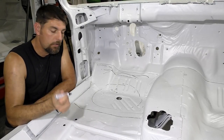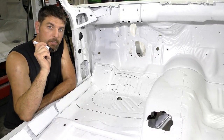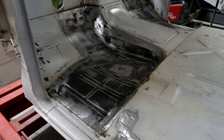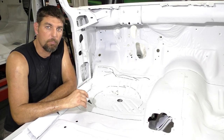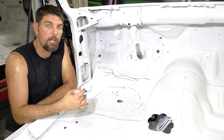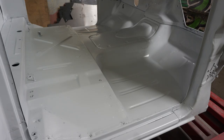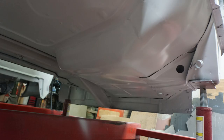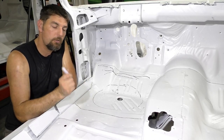Stay tuned — I'm going to cut it up. I know there are times I've done the truck right behind us with full floor patches because they don't make a full floor pan, and I did have to butt weld the floor patches onto the original floor pans. There's going to be a time and place you might have to do that. It just gets real labor intensive, but when it's all said and done, you can get it where it's really close and not be able to see it. This way we're going to do on this video is just giving you ideas on how to make your blend a lot easier on a patch.